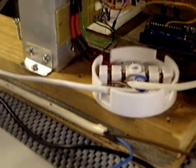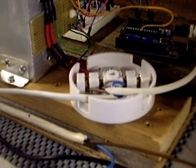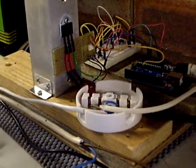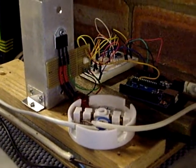So with nothing more than a couple of mains feeds and a double twist around the CT, you can check the operation of your Mark II power router. To convert this back for hopefully some useful harvesting of solar power tomorrow, it's simply a case of taking the wires off the CT, clipping it back to one of the cables that supplies the house, and reconnecting the orange wire to the triac. Then to make sure it works I will rerun the technique shown in the first of these videos, because tomorrow I probably won't be here when the system starts and it's important to make sure it's likely to work - otherwise you waste a day's harvest. Thanks for watching.